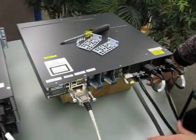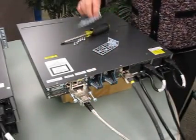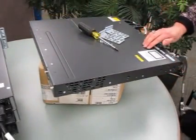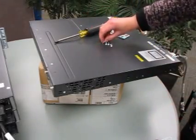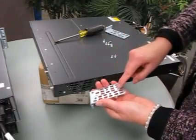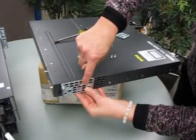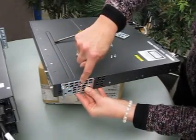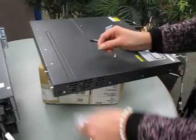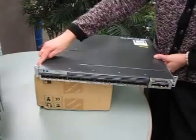From this switch's point of view, everything is connected and ready to go to put the next top layer switch in place. We'll also install the rack mount kits on the sides of the switches. Turn your switch around — you'll need your flat top screws and your Phillips screwdriver. The rack mount kits are notched on the back to fit into place, and there are three countersunk screw holes. You should be able to see them through the screw holes on your rack mount kit. Screw those in place. Now that we have rack mount kits installed on both sides, make sure they're even with each other.